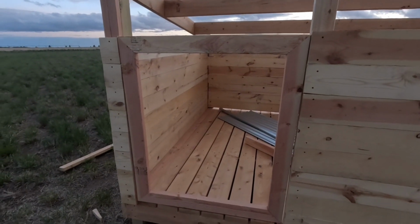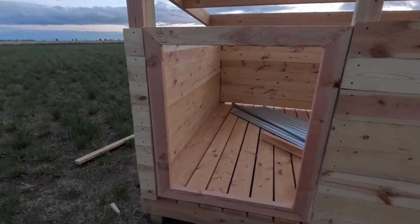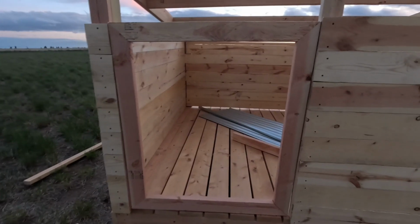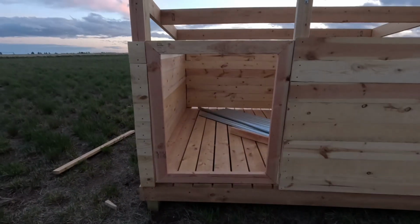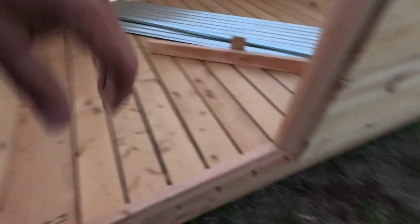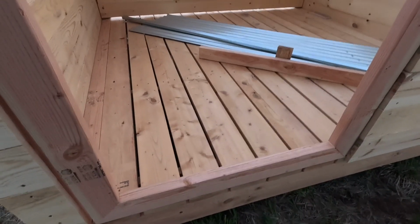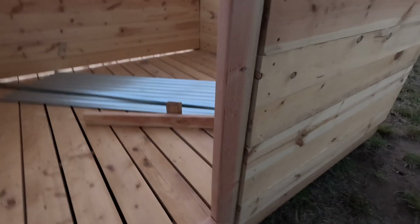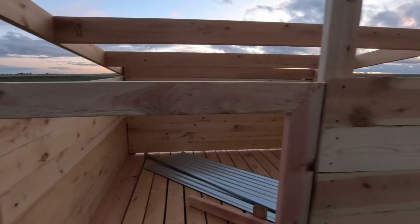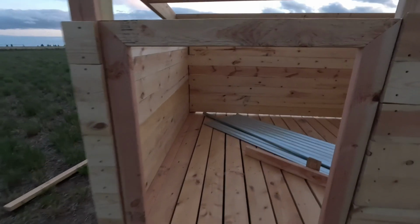Right, the height is good, because what I'm going to do now is put the boards, yeah, that should work, right? So I want the boards to come down a little bit further so that if the door shuts, the boards match the bottom. But as it is now, it's a little snug on top, but not by much. So I think I should be able to get Chris to use his planer and just shave a little bit off, like from here up, from that knot up, and I should be okay.